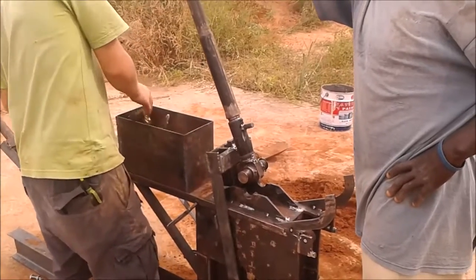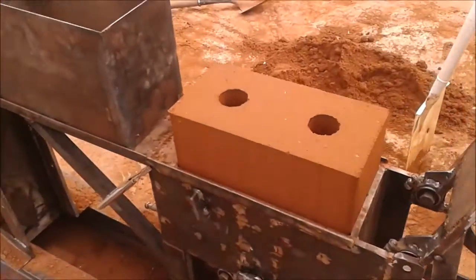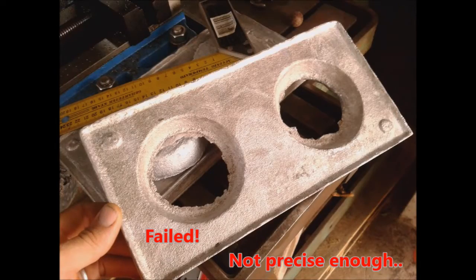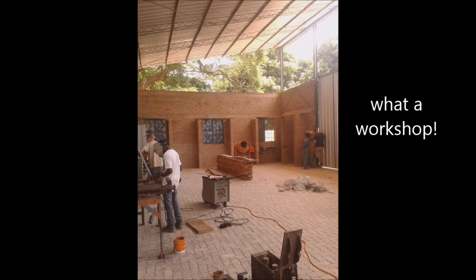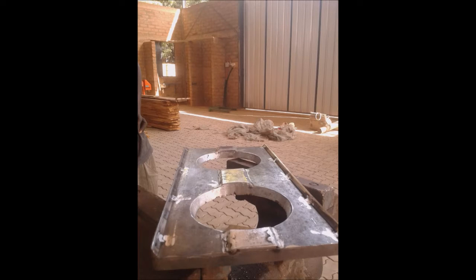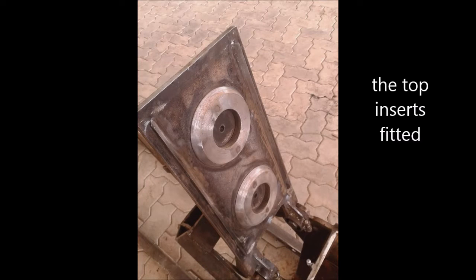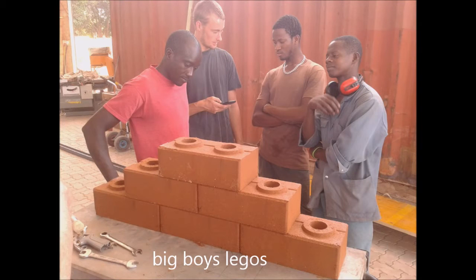Have to put that thing back on. Leaving just the inserts left to do. It turns out we had to use a plasma cutter and a lot of grinding, and put it together in the new workshop down in Tanji. Putting some chamfered edges on the block and a groove down the middle to keep it from rocking. On the top plate, putting those donuts and also a chamfered edge. Fit it well into the press — and there's our result: some nice looking Lego blocks. And then we have to relax.